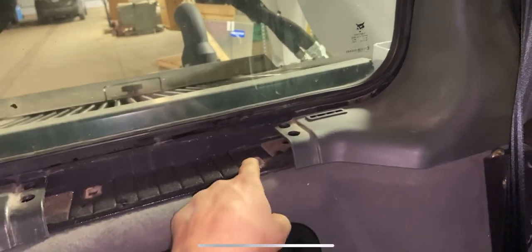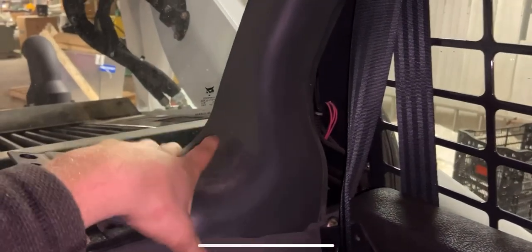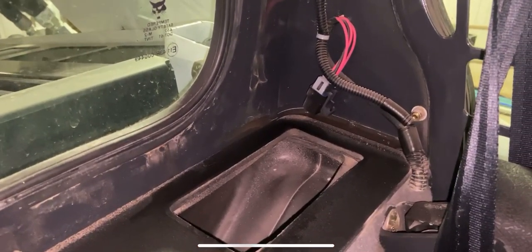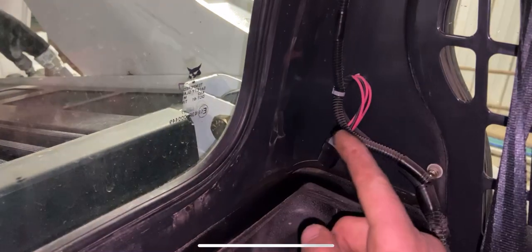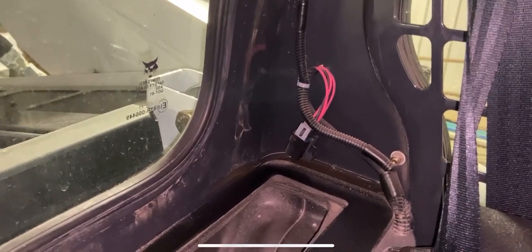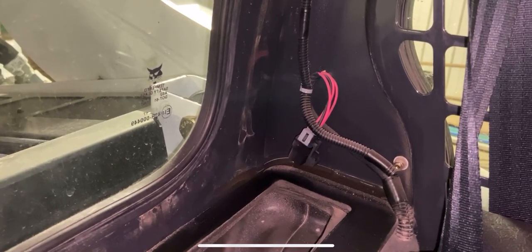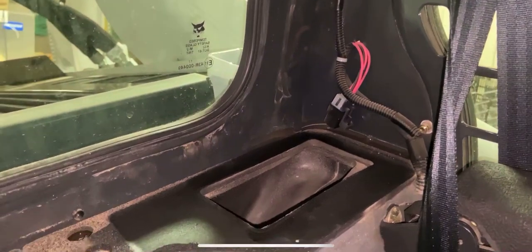Here's that clip on the back I was talking about — you can see it broke. You might have to fight with this a little bit; sometimes the foam here is stuck pretty good because you can see the defroster outlets here, and your heat for the cab actually comes up through the tube through the cab and out your vents. That's why it's got foam under it. Like I said, we're going to be hard wiring these into the Bobcat today — we're not going to bother with a pattern change. If we wanted to, you'd have to find a way to have a switch dangle back here or run one extra wire for the yellow light, bring it all the way down through the cab, and then put the yellow wire onto one end of a momentary on/off switch with a ground wire on the other end.